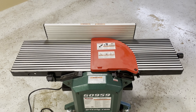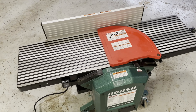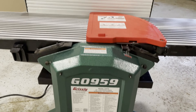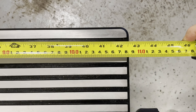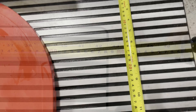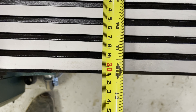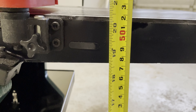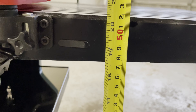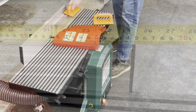Here is what it looks like — it's pretty big, 12 inches wide. The length of the table is 42 and a half inches, or 108 centimeters. The width is 12 inches, almost 31 centimeters. Sitting on the ground it's about 20 and a half inches tall. More importantly, the fence is about 5 inches tall and about 25 and a half inches long. Because it attaches only in the middle, you get a little bit of flex on the edges, which is one thing I noticed.